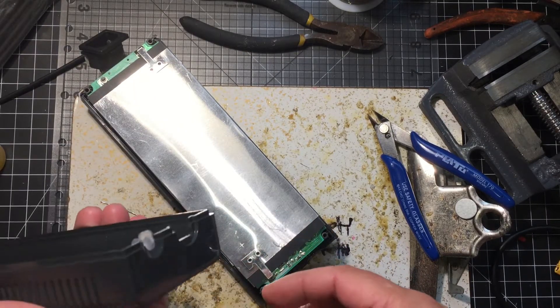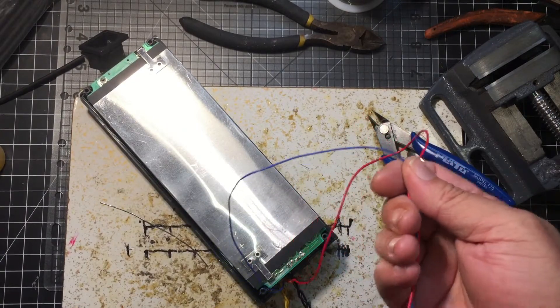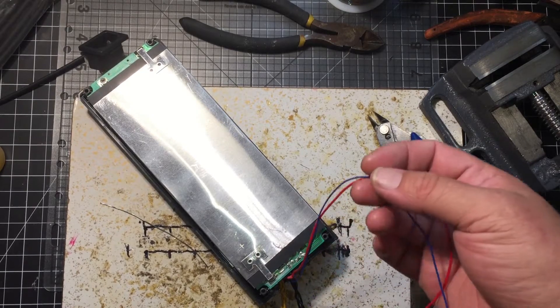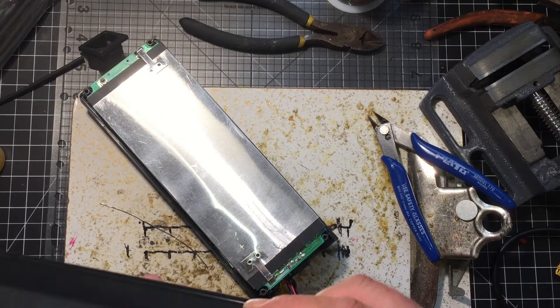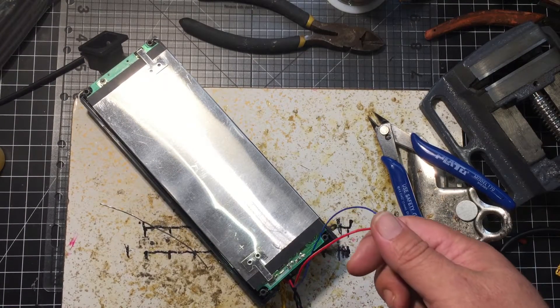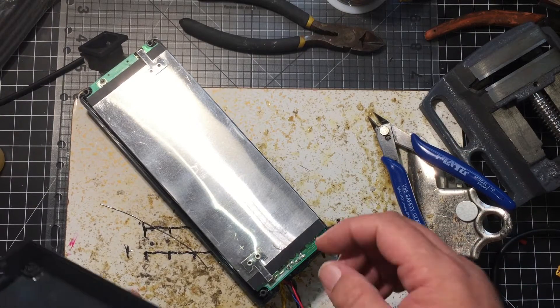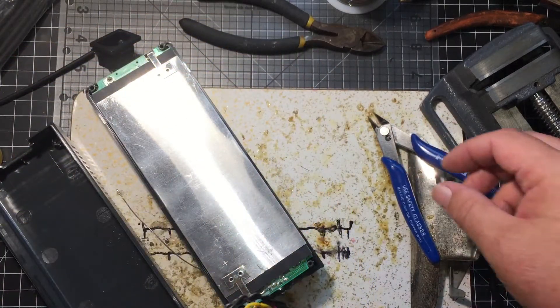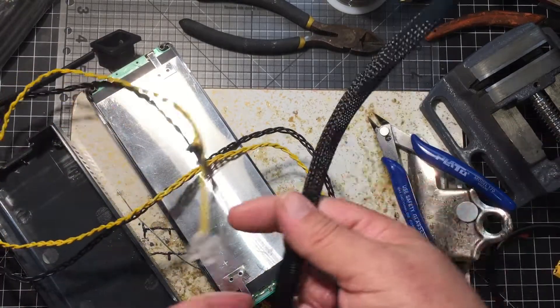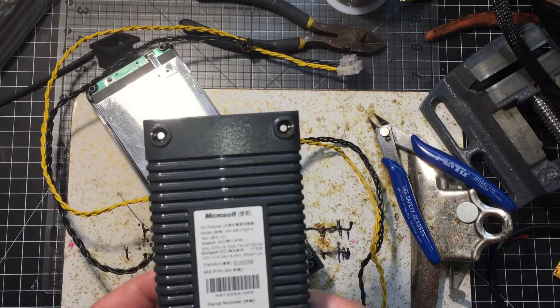What I'm going to do right now is take this piece and drill a little hole here. I'm going to put a little switch — that switch is going to be connected to the red and the blue wire, which is the five volt line and power sense wire. You put the power on the middle pin and the sense wire on the top pin, and it gives you the option to turn this power supply off and on whenever you need it. I could add a USB port too, but I have no use for another USB. So for right now I'm just going to trim this, drill a hole, then solder an XT60 connector to it and add some sleeving to make it look good. Hopefully after I'm done I'll have a power supply that is 170 watts at 12 volts and 14.2 amps.